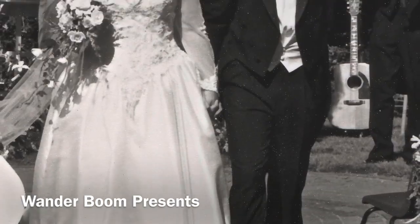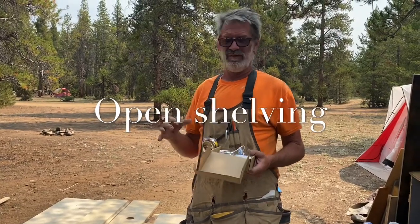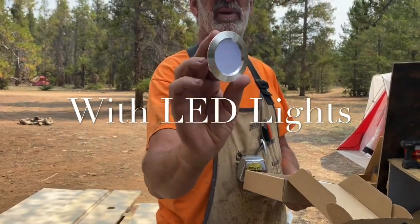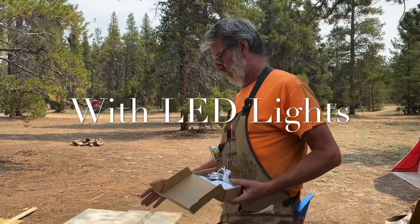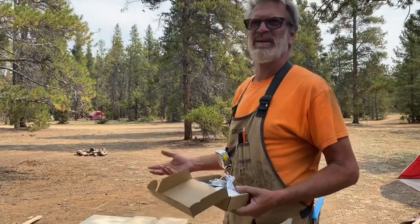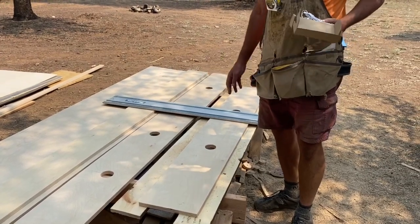We're on the bottom of the two shelves — they're going to be open shelves. How do you mount lights in something like that? These are the puck lights; you can get a six-pack and we'll link that on Amazon. You need to lay it out evenly. The top one is an eight-foot shelf, so even spacing worked out to 19 and 3/16 inches. This one is 68 inches, so that's 22 and about 5/8 inches for the spacing.